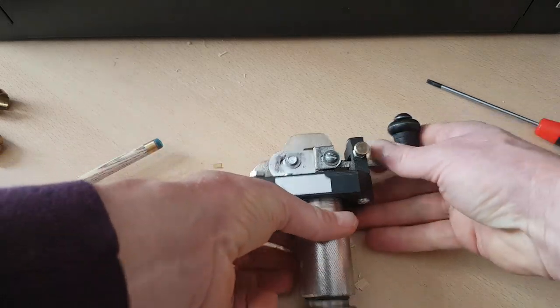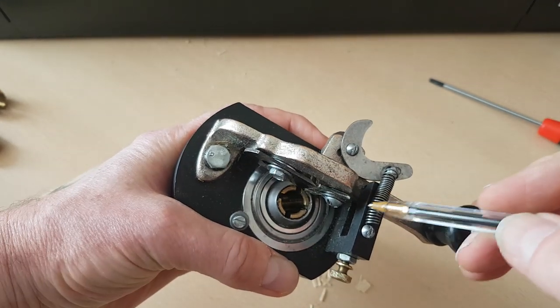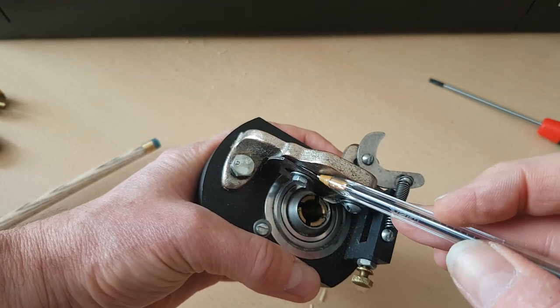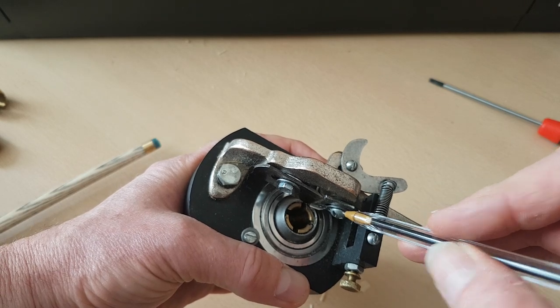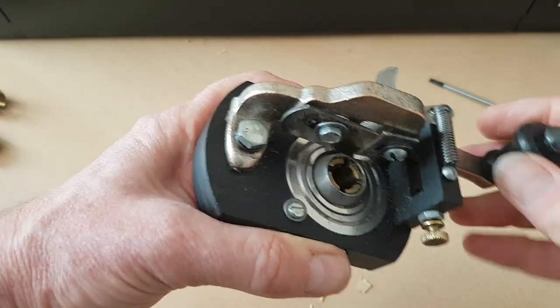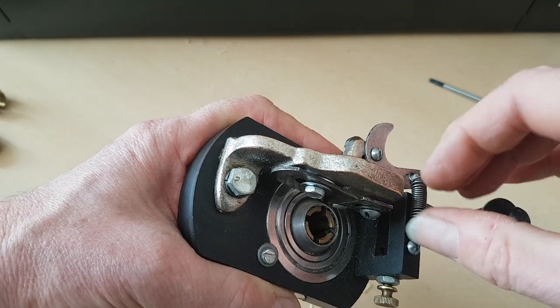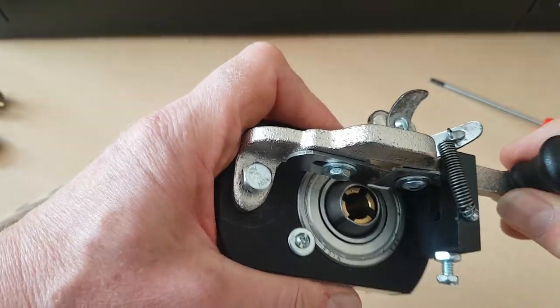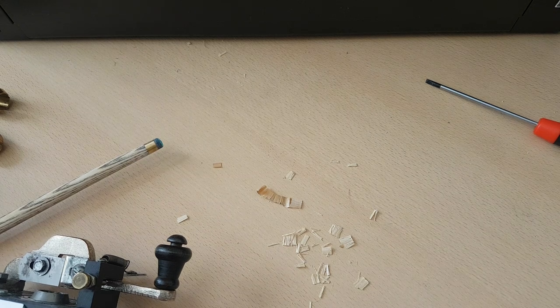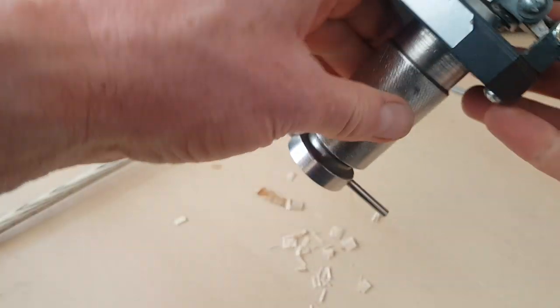What I found out is that as the tension wears, what you can do to get over it is find some very thin washers and put them in between the cutting blade for the tenon itself — so it's in the back of there — and another one on this side to bring that mouth out again. You don't need to put anything on the bottom. Start with something really thin. What it does is mean that when the blade gets into the tenon, it's actually pushing the spring more — using a bit more of the spring's strength rather than where it's lost its tension. I've not actually seen replacement springs, only replacement collets and blades, so maybe that's something we'll try and get from Tweeton's. But the washer fix will certainly get over it.